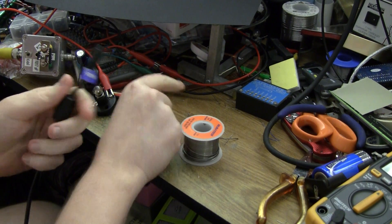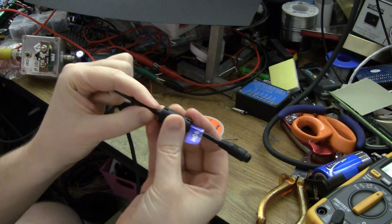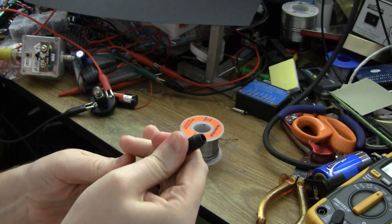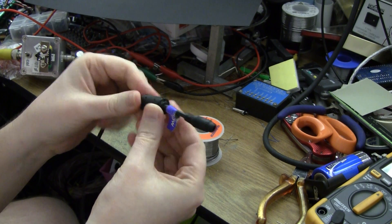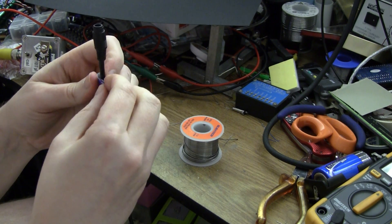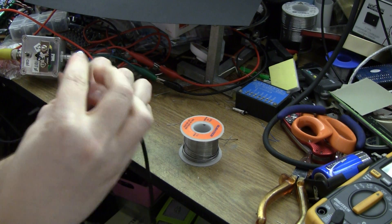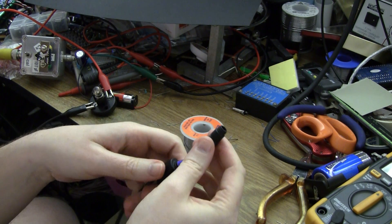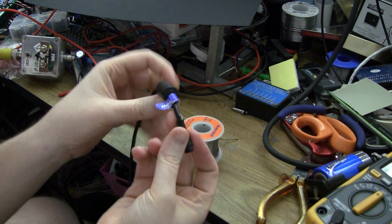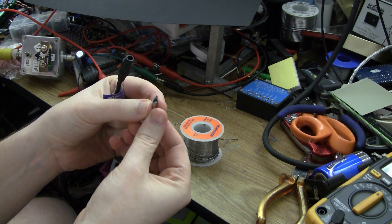It says 90 watts here, which is about right if you do the math. The ferrite bit is glued onto the cable, so that's kind of a limiting factor — I don't think I can push it along. It wasn't clamped on or anything like that, so I'm kind of stuck. It looks like it was injection moulded in place — there are some sprues here that suggest that's how it was made. That label has always annoyed me but I've never bothered to take it off. If I could push the boot down a little bit, but it looks like it was also injection moulded around the connector, so maybe our solution will be to find some heat shrink, rip this boot off, fix up what is probably coax inside the lead, and solder it back onto this connector, tip-positive style.